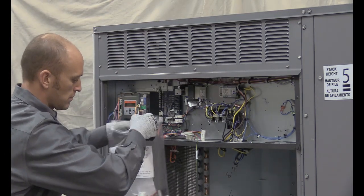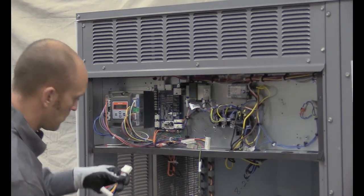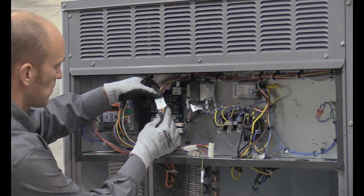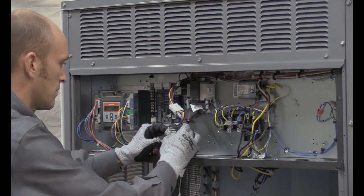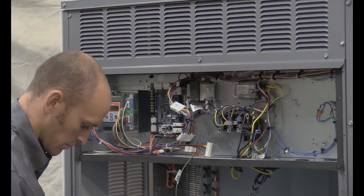Locate adapter 48TC003199, the plug with two white ends. Unplug the econ plug factory attached to the unit control board. Now connect this 12-pin plug to the 12-pin end on the adapter plug. Then connect the 10-pin female end to the 10-pin male plug from the Jade Controller.